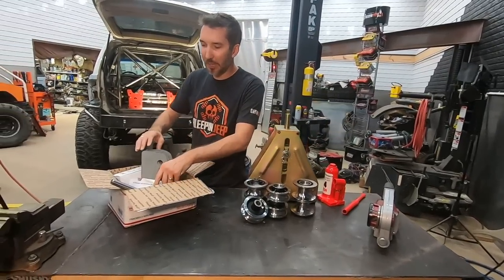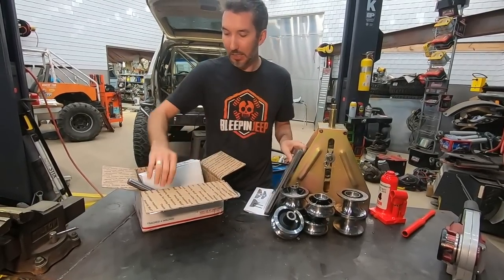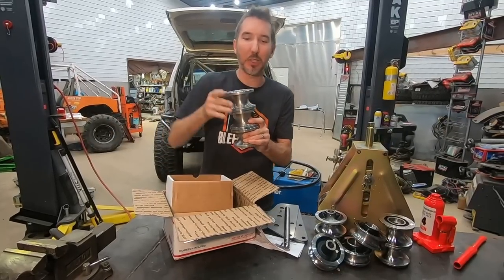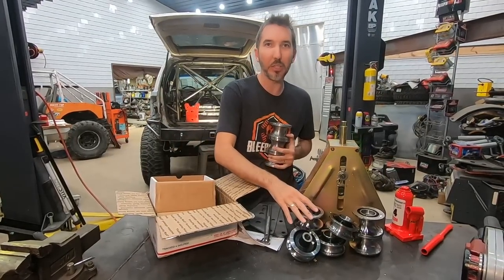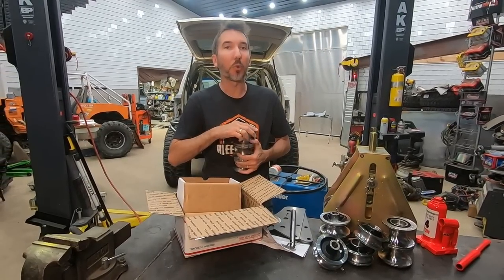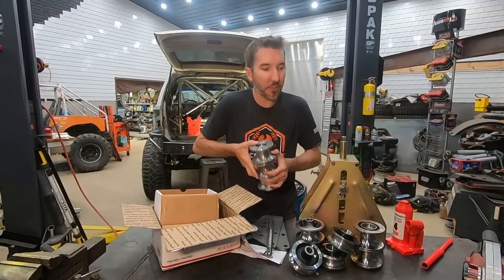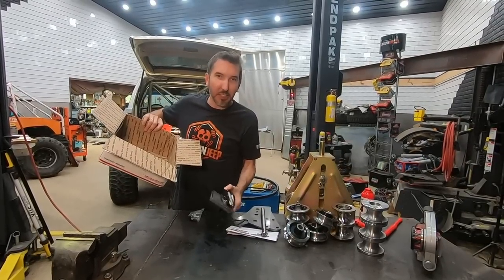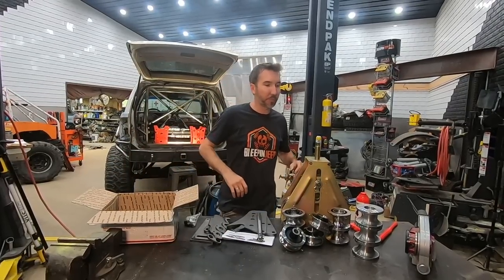And then we've got some extra things. So this is gonna add some wings to this. It's gonna make it wider. It's gonna give you a new axle. We've also got new dies. So the Harbor Freight roller doesn't come with 1¾ dies, and that's a pretty popular size in the off-road world. We're gonna be using 1¾ tubing. So we've got 1¾ dies that are gonna go onto this thing. And then there's a couple more components in this kit from Swag that is going to make this into the Uber Tuber roller. That's just what I'm calling it.